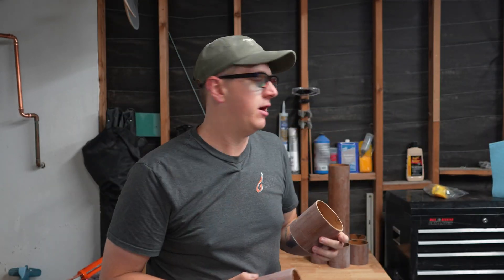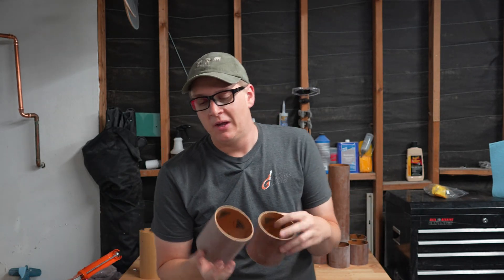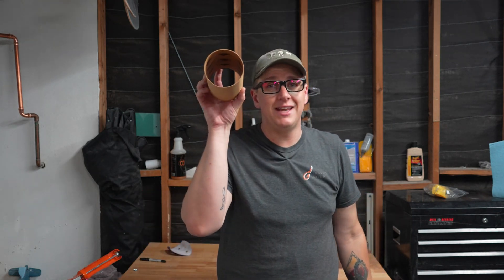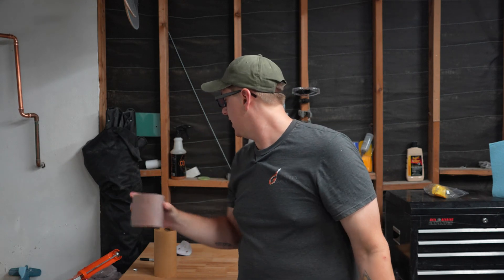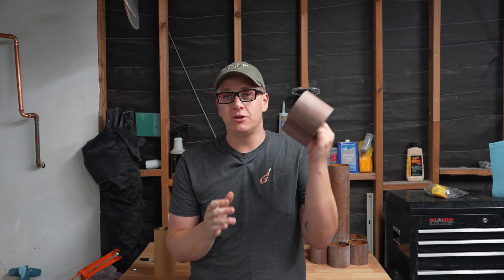For the simplicity of transport I would like the top half to not be glued in. I've been staring at these on the shelf since I built this thing trying to figure out what I'm ever going to use them for and I've landed on something. We're going to measure the diameter and calculate the circumference of the outside of these pieces and do the same for the inside of the coupler tube. Then we'll take a sharpie, mark the difference on these, cut slots out so they can pinch together and slide inside the coupler. If you're familiar with our 12-inch Wild Man Punisher upscale we did something similar — that's why the center coupler is like half-inch thick wall with reinforced fiberglass. I could stand on it and use it as a trampoline. This will make it nice and beefy and best of all be free because I already have this stuff.